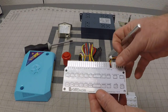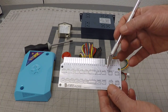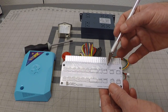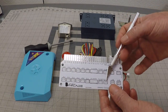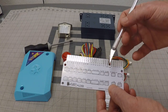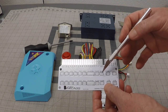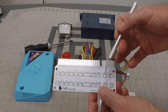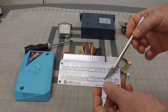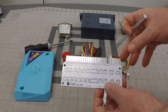One good thing about this board is it also has your coin. On a lot of the JAMAs for the Pandoras, the coin button has two wires but it's all based off of the player one coin. They don't usually have a wire on the player two coin because Pandora's Box doesn't use a first player/second player coin system — it's all one central bank. But on the DXs, the coin two wire is used for a pause button, so this will easily let you install a pause button on your machine plug-and-play without having to solder anything to the actual JAMA harness.